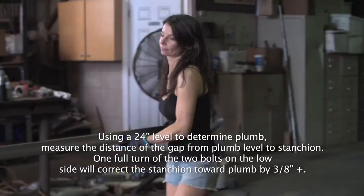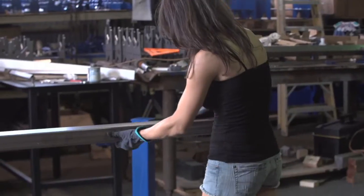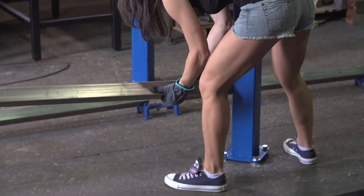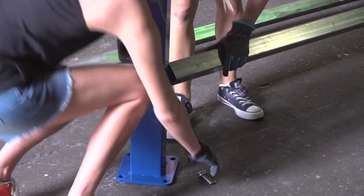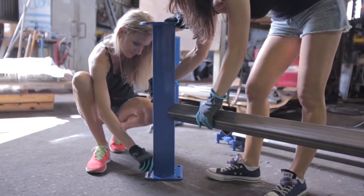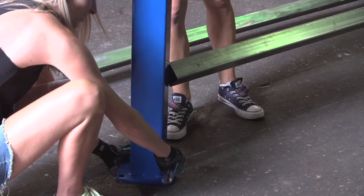Locate and carry the approximately ten foot square tubing mid rail to position on the stanchion with the ear. Position the mid rail on the ear diagonally as shown. Lift the other end of the mid rail and insert the ear of the other stanchion into the mid rail. Slide the stanchion over the anchors. Locate the drop-in anchors and secure this mid rail stanchion base similarly to the other three stanchions, then finish bolting down.